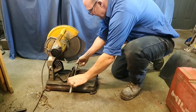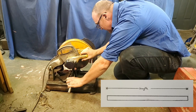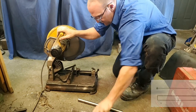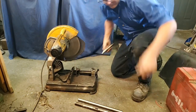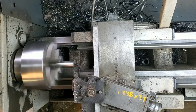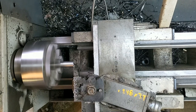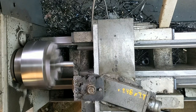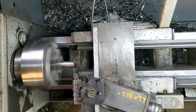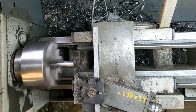Let's grab some one-inch precision ground stock off the wall and cut it to length — 16 and an eighth. I'm going to leave an eighth of an inch or a little bit more, because I'm going to go back in the lathe for the final operation and cut it to exact length. I'm going to face off this one-inch round stock just to square it up, then put a 45-degree chamfer on the end of it.